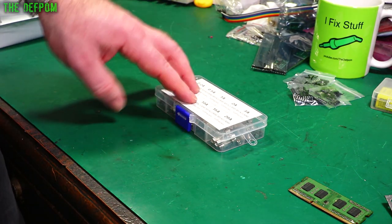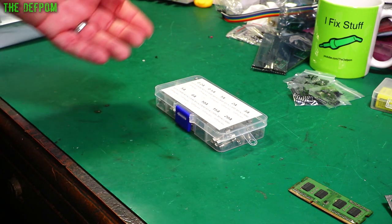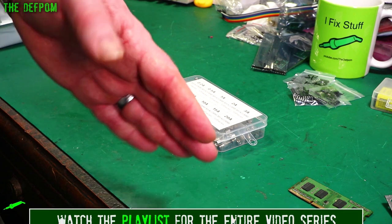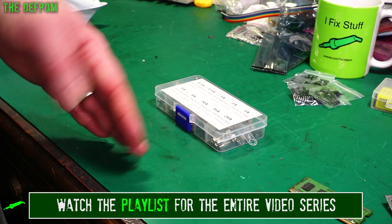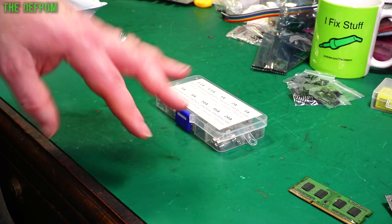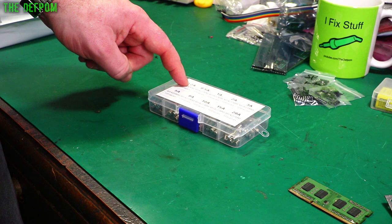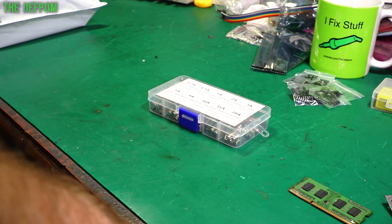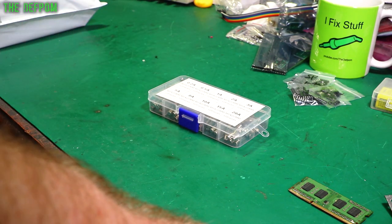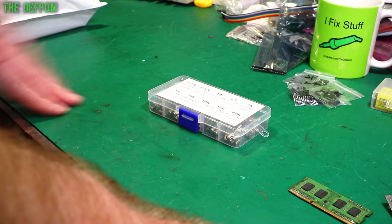One of the reasons I got these is for those Datron multimeters I repaired recently. The fuses need replacing, because I've changed from 120 volts up to 240 volts. Because of that, you're supposed to change to a fuse for a lower current, because of the higher voltage, for the same power. I didn't have any small enough fuses, so now I've got some 0.2s, which would be good enough, I think. I can't say exactly what it's supposed to be, but hopefully it's 0.2s. I did get some 0.1s as well, got those in the previous mailbag. So, anyway, we've got fuses there.